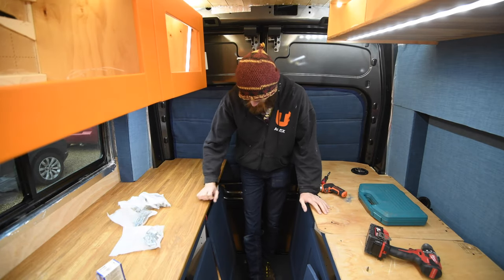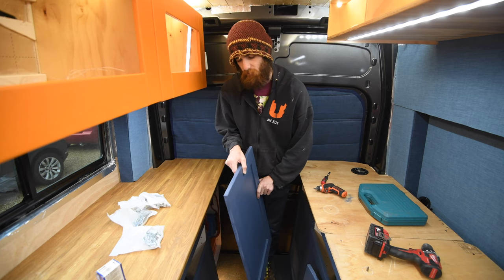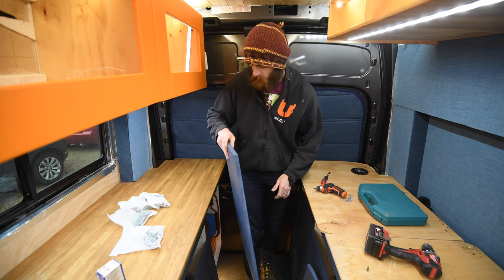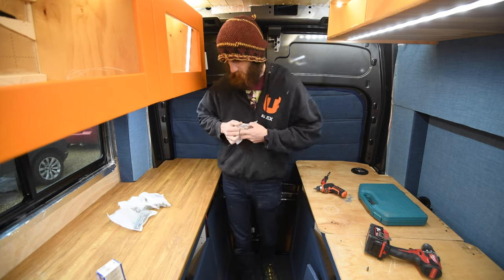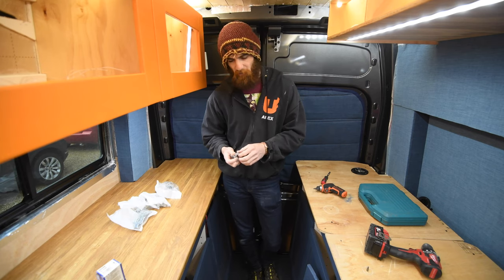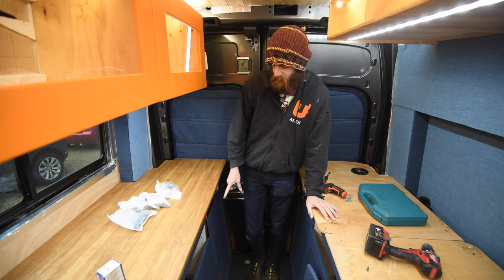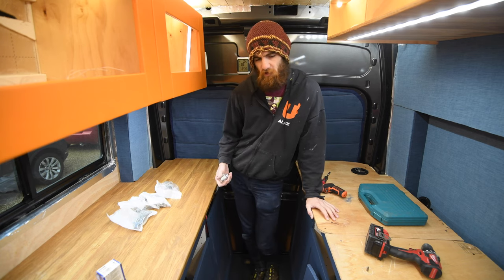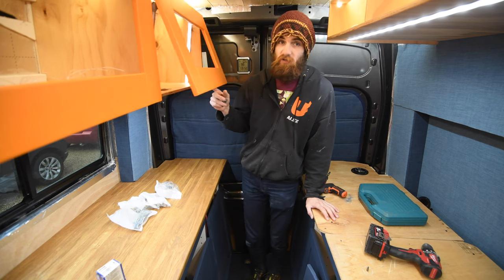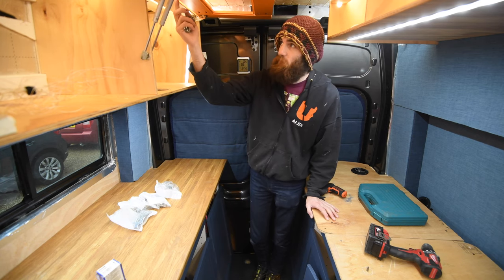It's the following day and all the paint has dried — I didn't show most of that because watching 4K footage of paint drying is about as fun as actually watching paint dry. I'm going to be mounting all the doors with the hinges. I've gone for these easy-mount hinges. I tried the standard kitchen ones where you drill the big hole, but I was struggling with the mix of half overlay and full overlay doors. With these, if I make a mistake it's just a small screw hole rather than a huge one — the same hinges as the upper ones.